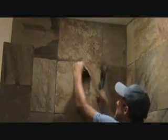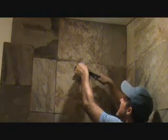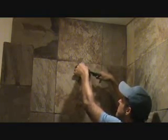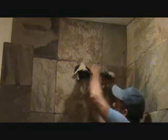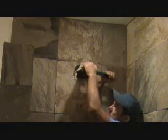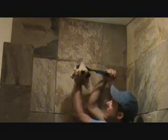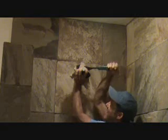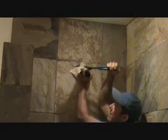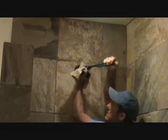Make sure you put your rag back up there. If you don't have a rag, could you tighten this? Yeah, you probably could — you just want to be careful with it. I'm going to hang on to the head here because I don't want the head to spin. If the head starts spinning when I'm tightening this nut, that means I'm not tightening the nut. I don't want to get it too tight because I don't want that plastic nut to crack.